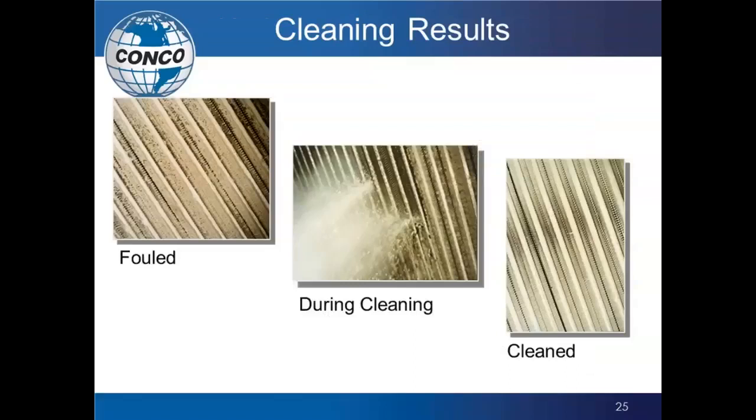What kind of cleaning results are you looking for? The left picture shows fins with some air getting through in the upper corner but completely plugged in the center bottom. The center picture shows the cleaning process with water pressure getting through. To the right you can see fins still fouled — not yet cleaned. But looking at the top of the center and left picture, you can see where the fins have been cleaned, a marked difference. As fouling gets removed, tubes become much cleaner, and when done, they look almost brand new like in the far right image. That is the type of cleaning you are looking for.